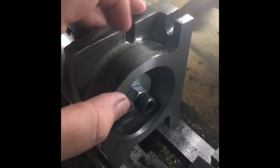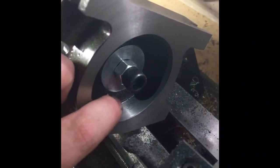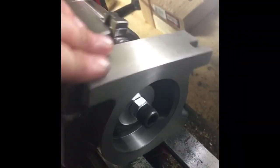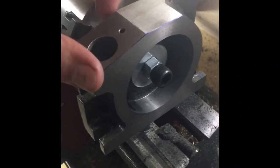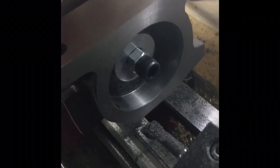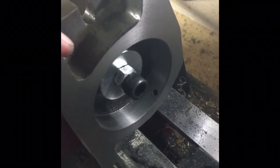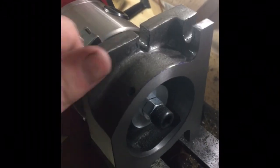All faced and cleaned up all the way — I bored it all the way back to just clean up. Whatever size that ends up being, I'm going to make a bushing for the table to be a nice rotating fit in there. I'm just going to chamfer this a little better, and then it'll be on to the other side.